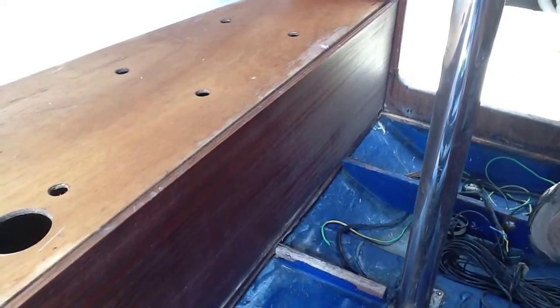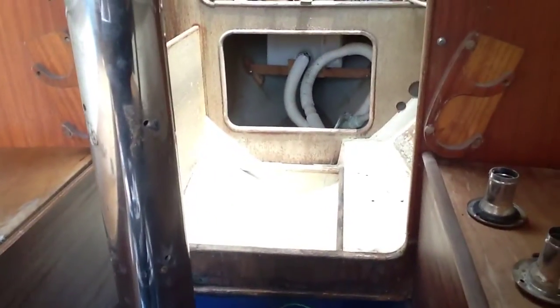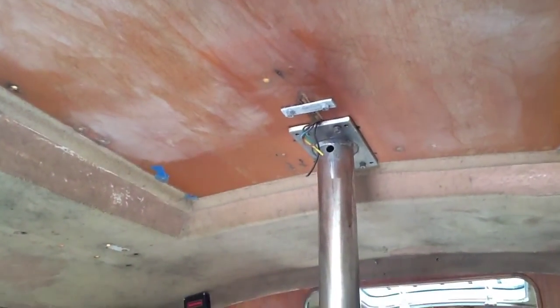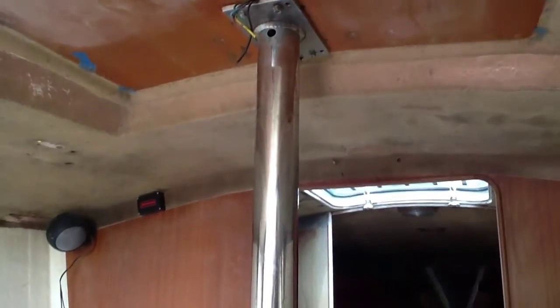When the original owners bought the boat, water was probably almost halfway up the side walls, so it was really in pretty tough shape. You've got a holding tank back there underneath for the head, and pump-outs are up on deck. But all in all it's a really good strong structure. This area here I don't know might have water coming down the compression post and filling into the bilges — that's my only place I'm not sure of, and this is where I'm going to need to sit in a rainstorm and try to figure this out.